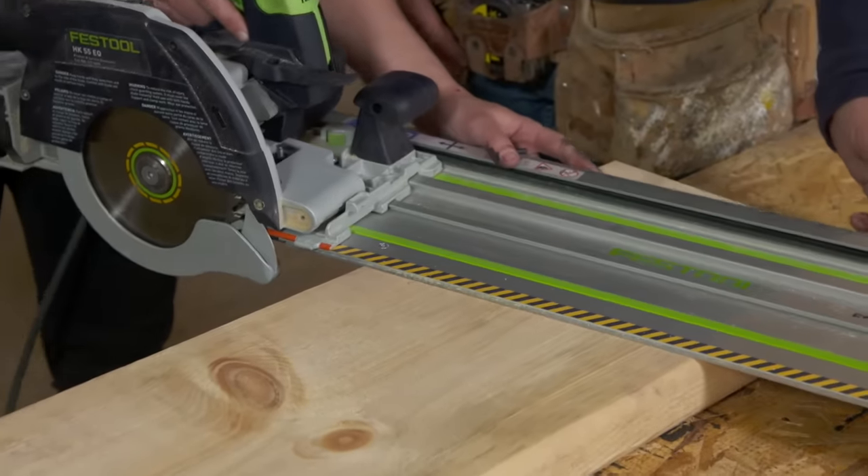So what do we call this — pre-fab, pre-cut? It's a pre-engineered, pre-cut, post and beam barn kit. We manufacture this at our facility in Connecticut, ship it out to site, and all the parts are pre-cut and color-coded — they correspond with the color-coded plans. We spend the day working with the customer and his carpenters and hopefully get this saltbox frame raised. This is the real traditional way of doing a post and beam barn — traditional joinery with the mortise and tenon. You've got your pegs that have already gone in. We're working with eastern white pine here, all stamped and graded. This is a full-dimension six-by-eight post and a full-dimension six-by-ten tie beam. Post, beam, post — those are called bents in a traditional barn. There'll be three of them in this building. This first one goes on the far wall — let's get it up.